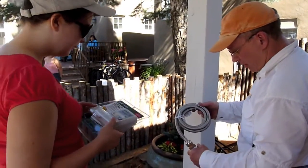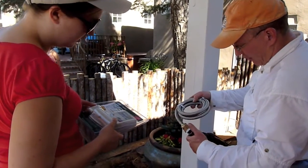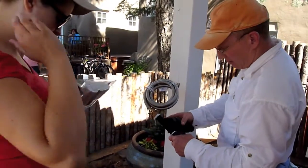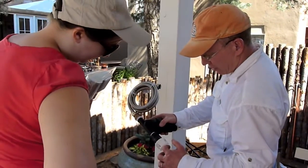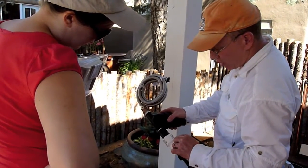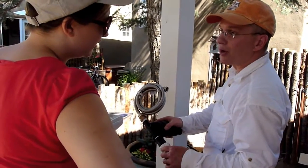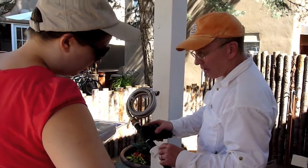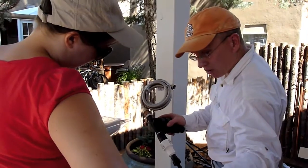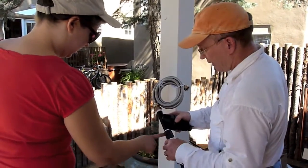And then this, I'm doing mine a little different. You don't really need this. I'm going to lay mine on the ground just so it hides it. But from there, it would come into here, which is a filtration system. This is a backflow preventer, or this is a filtration and backflow preventer. This is a pressure reducer, so it maximizes 30 psi. Most city water could be 50 to 70 psi, which puts more pressure on the little line than it really needs. And then that just plugs into this hose, this stuff we're laying around here. So this plugs into this. Right. Plugs into this.